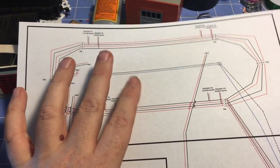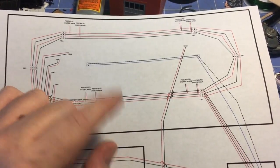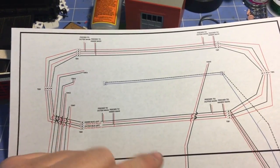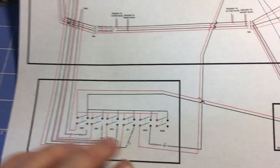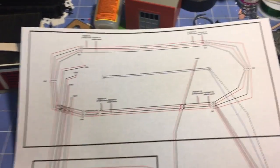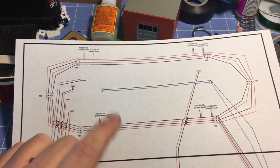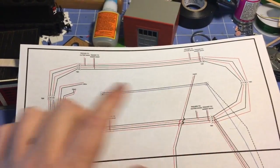It's going to be a custom powered AC bus — it's actually not going to stay powered from there. I haven't decided how I'm going to do that yet; probably going to build a small AC power supply. Other than that, I just have two main buses running basically underneath the two main tracks so I can drop feeders and tie into it wherever needed. I'm not doing block control or any of that with my tracks. My intent is to make this easy to convert to DCC when I start growing my track. Either way, it's a very simple way to wire it — if I ever wanted to do zone control, I basically just interrupt where my feeders are and don't really have to change much.